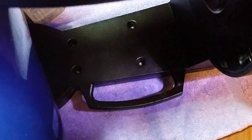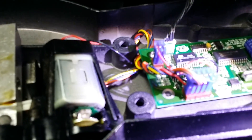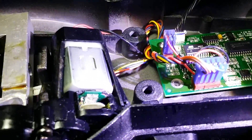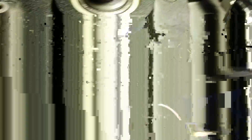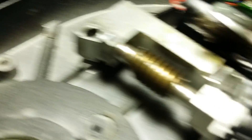They're Allen heads — I had some that fit — and I was able to move this off. Okay, there's your GPS cable, it goes up on the side of the fork. The control panel connector goes back here for the power and everything else — handbox, auxiliary — and this is the power and control board. The power goes to the motor and comparators. What I've done was remove the two screws here and one there.